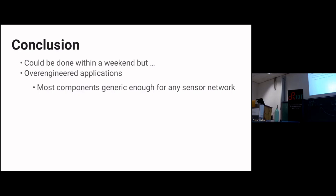But I would say I can push it to public repositories, there's no blocker there. Whether this P1 port is available in other countries, I know Belgium has them, I think Sweden also has them. And I know that modern German power meters, I'm not sure how rare those are, seem to have a more pure IEC implementation of the specification, implementing also a protocol mode. I thought there was an implementation over infrared LEDs, often used by some electricity meters. So if you're in Belgium or Sweden, if I remember correctly, it's easy. If you're in Germany, maybe.